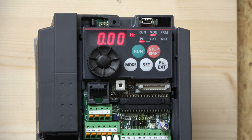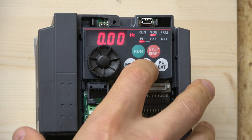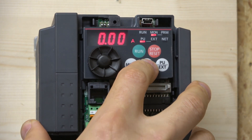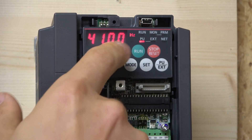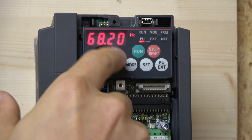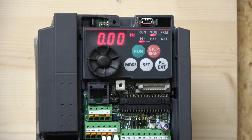Be aware that there's a parameter number called 79 — if that has been changed from zero to anything else it will not let you switch modes, but by default it will always be on zero. If you've got a new drive it will be on zero, but if it's not, you can do a full factory reset to reset everything back to factory settings. You can also use the set button to jump between different readouts while the drive is running — it usually sits on hertz. You can also use the dial to change frequency, and when you click set it will accept and store that frequency.